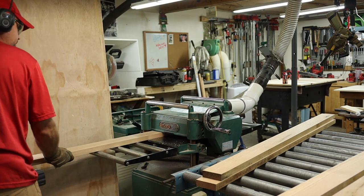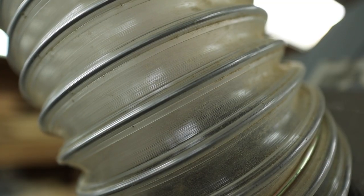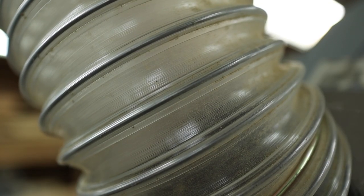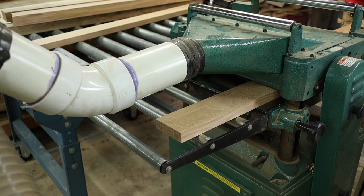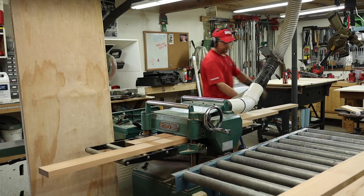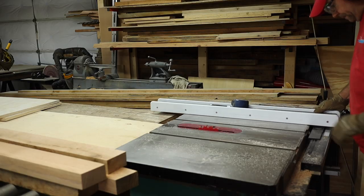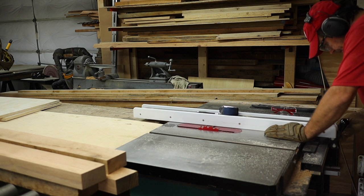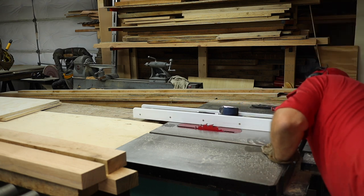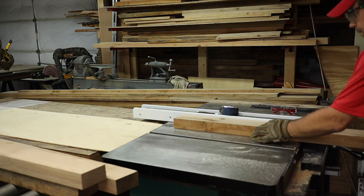Unlike our diesel tanks, our water tanks are freestanding, so they don't have any plywood bulkheads to rely on for support. So they will need some kind of internal structure to attach the plywood to. Without an internal structure, we would be forced to attach the plywood to itself, and while it'll hold fasteners very well across the grain, along the edges would be a weak point. So using white oak as the internal structure is going to add a significant amount of strength and durability for the long term.